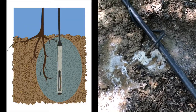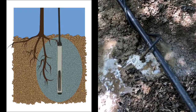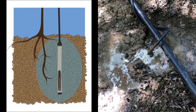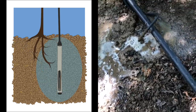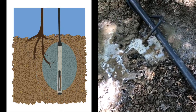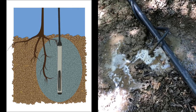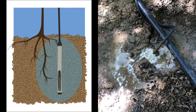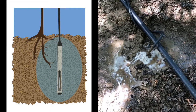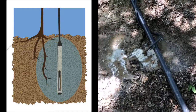It's been about 10 to 15 minutes since we turned this on. We stuck that emitter in the ground and it was weeping. Now we have a wet spot and a little bit of foam there. That foam means we pushed some air through the system. The wet spot lets us know that we're putting water in the ground slightly faster than the ground will absorb it, which means we're building up pressure and building up our bulb of saturation underground. You want to see that wet spot last for several hours before it starts to get bigger. Once it starts getting really big, they'll all be getting big at the same time, and that's the time to turn the water off.